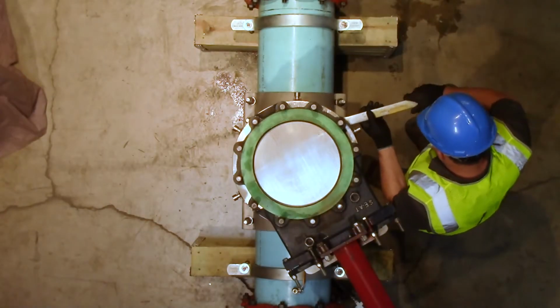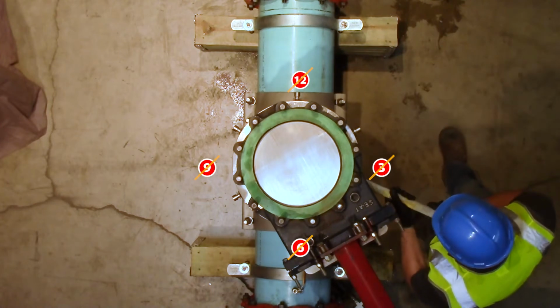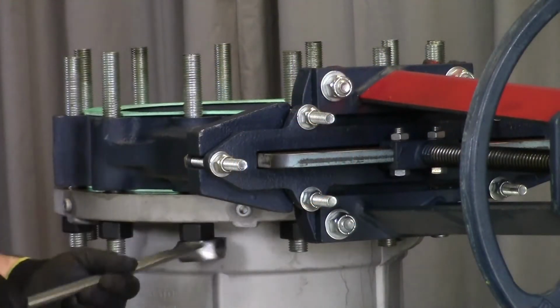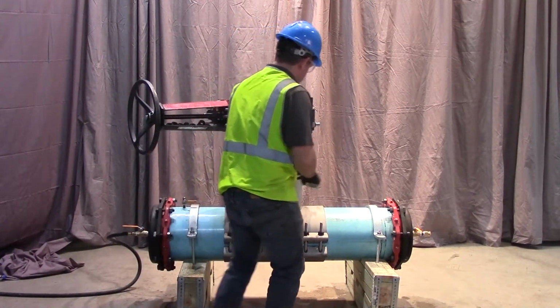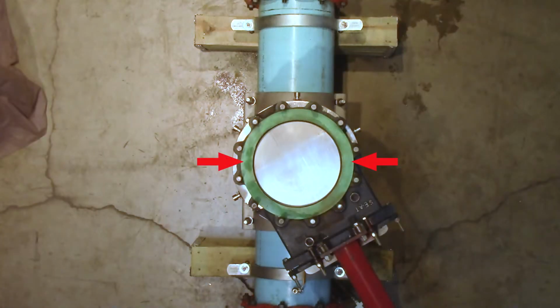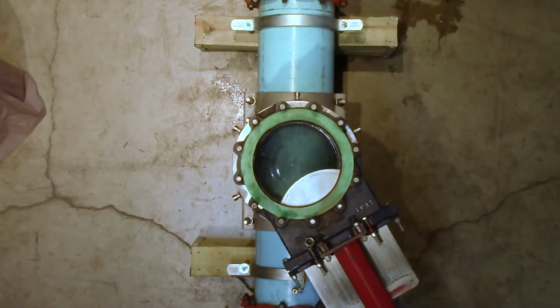If possible, avoid positioning the valve at the true 3, 6, 9, or 12 o'clock position to allow access to the completion plug pins. Bolt the temporary gate valve to the top of the IV250 flange using the bolts, nuts, and washers provided with the installation equipment. Ensure that a green fiber gasket is installed on the top of the temporary gate valve. Fully open the temporary gate valve.